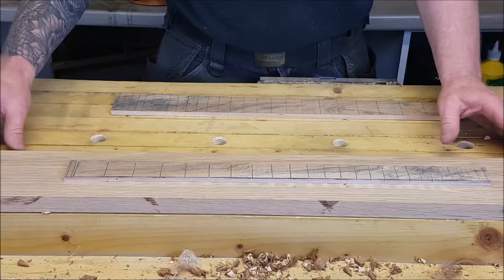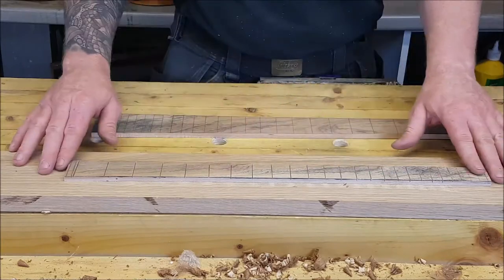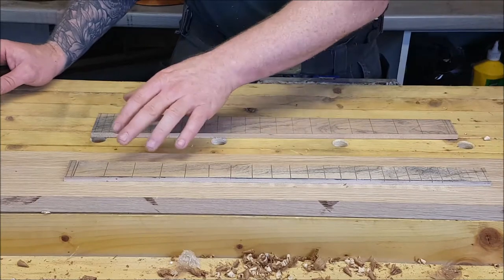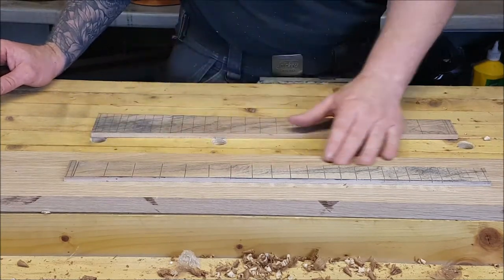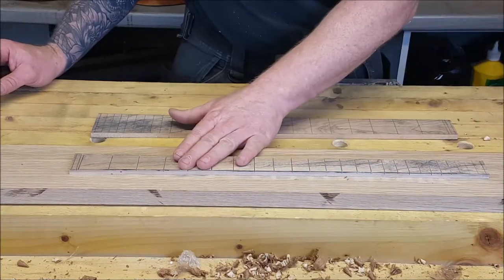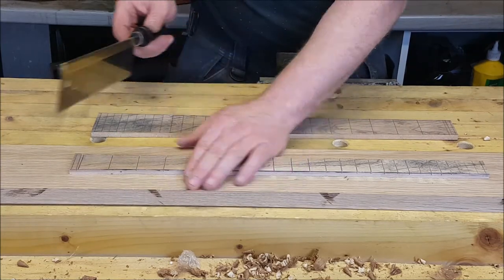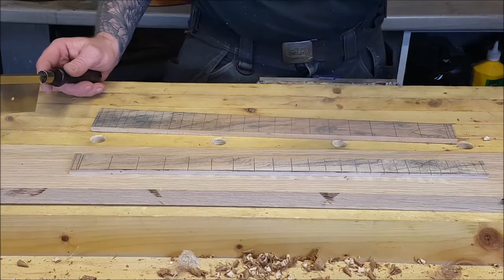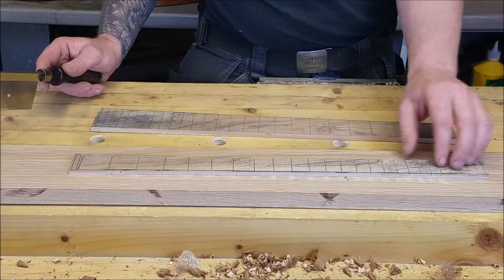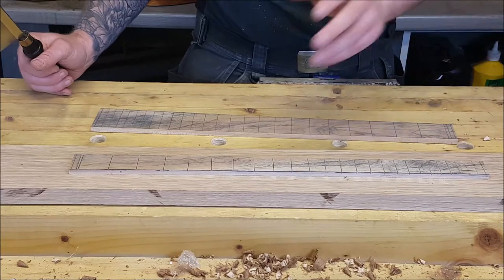Guys, you should be able to see that there. So I've had a go on the off cut piece that I cut off the fretboard blank. This had all the same lines on it, and I've just been practicing with the fret saw, and it's not too bad. I used a piece of double-sided sticky tape just to stick it to this piece of oak, just for something to grip to and to stop it moving around. And then it's just a case of take your time, keep your saw nice and straight, and I'm not going to go to full depth. What I want to get is just go down a couple of mil to get the start lines in it, and then I'm going to radius it so all these lines will still be there, and then I can put them to their final depth when it's on the guitar and I'm hammering in my frets.